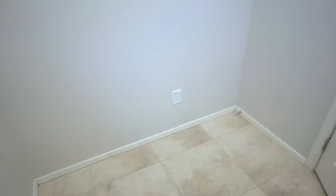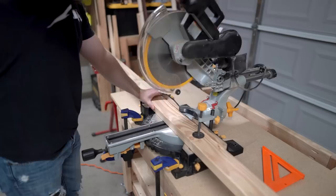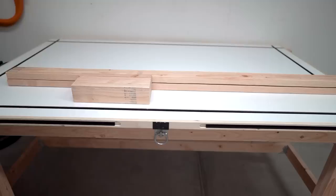Here's our laundry room — it's really plain. We wanted to do like a mudroom kind of deal, and I thought a floating bench with hidden storage would be cool. I'm using my miter saw for the cuts for everything. There's going to be a lot of repeated cuts, so make sure and use a stop block — it'll speed that process up. My measurements aren't going to be the same as yours, but I'll list some of my cuts in the description.